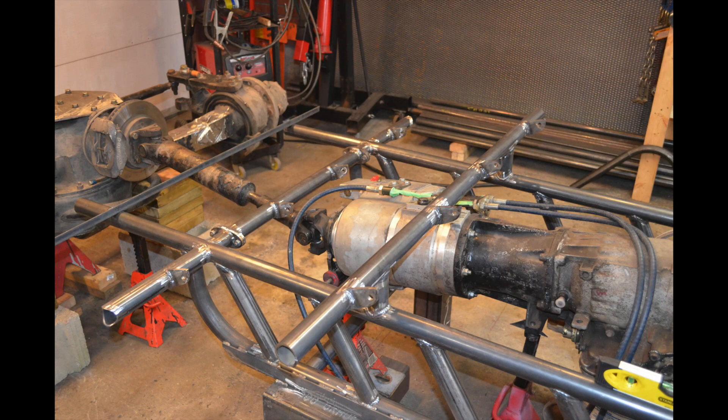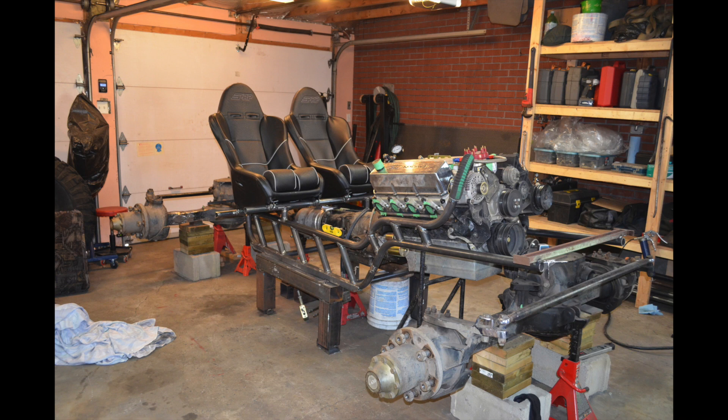That's why I positioned the seats right behind the engine. It took quite a bit of trial and error — I first used some two-by-four pieces of wood, laid the seats on them, and tried to figure out the farthest distance back behind the engine I could position my seat while keeping my feet comfortable in front. My right foot ends up about five or six inches behind the back of the engine head, which is where I'll position my gas pedal. After finding that spot, I set the seat on the two-by-fours and moved it back and forth to find what's comfortable.